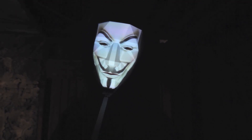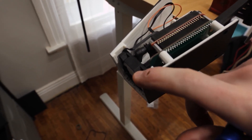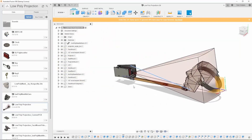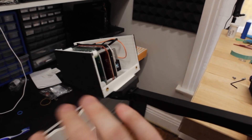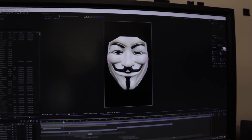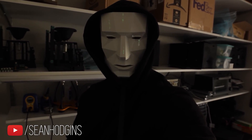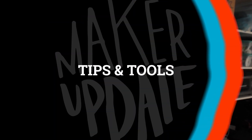And it was too late for me to include in the Halloween episode, but I can't not talk about Sean Hodgins' face-changing projection mask. Using a Raspberry Pi Zero W, a mini projector, and a USB battery pack, Sean made a little Pi projection mapping system that sits at the end of a wooden stick attached to the mask. With the geometry of the 3D printed mask, Sean is able to map videos and images to it with just the right warping and contours to look natural. It's a great idea, and I think it'd be cool to adapt it even just to sculptures or things that are fixed in place, which would open up your options on projectors.